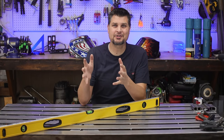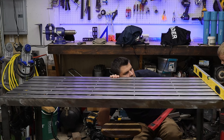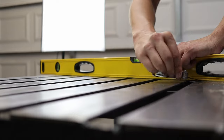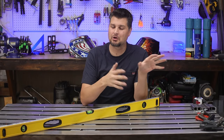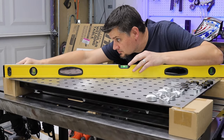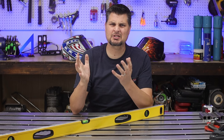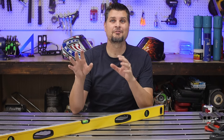The golden question: how accurate is it? It works for me. It's not perfect — it's not like a machined cast iron table — but for only being 24 thousandths off, that is pretty dang good for being built on my concrete floor. And it is a lot better than my new titanium modular table — I just did a mini review on that — that sucker was more than a tenth of an inch out. Which kind of begs the question: if you're doing a fixture table in mass production, why aren't those suckers being built on fixture tables?